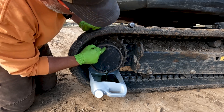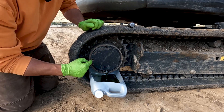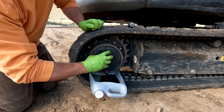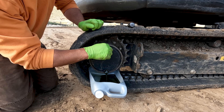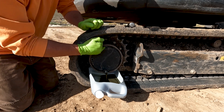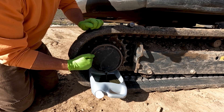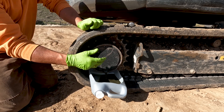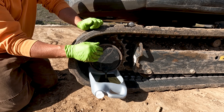When I look in this hole, I can see one of the planetary gears blocking my fill hole — that's okay. But when I look down at the level plug, there's not a gear in the way. The planetary rotates inside here, so it may or may not be blocking your hole when you go to fill with oil, making it difficult to get that thick gear oil in. Since there's no gear blocking the level plug hole, I'm actually going to fill from there. Quick tip: if a gear is blocking both holes after draining, just put the drain plug in, drive the machine a little bit one way or the other, and that'll move the gear out of the way.